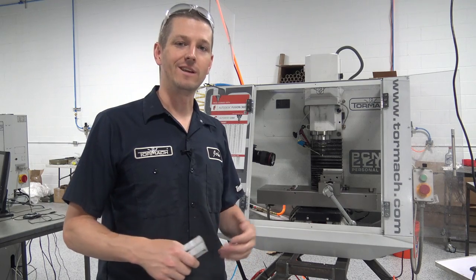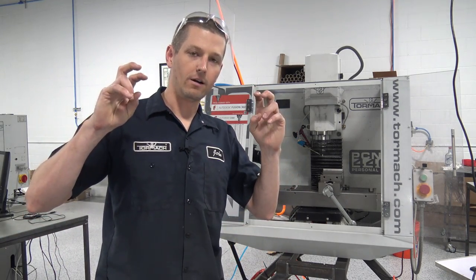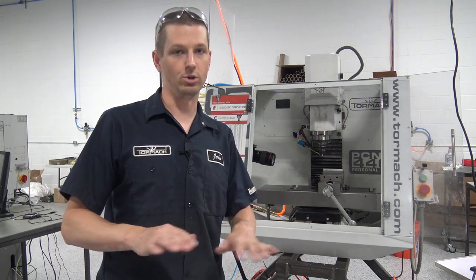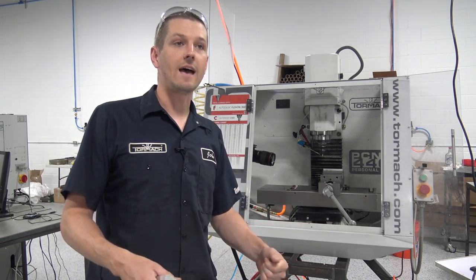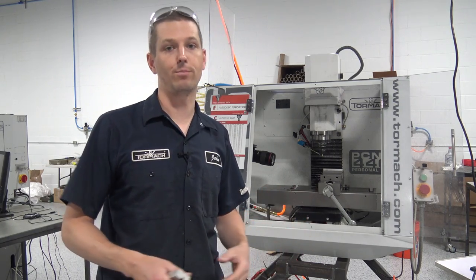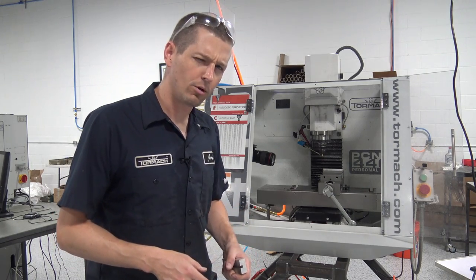And I had always sort of believed that anything under quarter inch starts to get into the be careful area, and under 1/8 of an inch is like, okay, woe is me, fragile tooling, blah, blah, blah. So Tim was mentioning chip per tooth of like 3/1000. And my go-to, and we talked about this in our speeds and feeds videos, was 1/1000 per tooth. And that's okay, and there's nothing wrong with that, but I was pretty blown away at this.